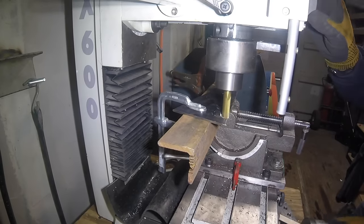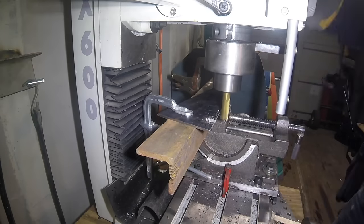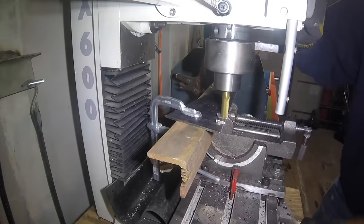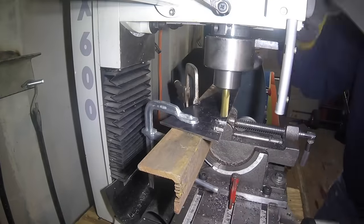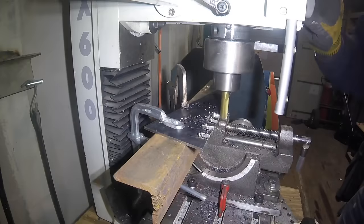What I do here is just touch the cutter to the edge to get it lined up. This is a half-inch end mill I'm using, and then I went in three-quarters of an inch on each one of these cuts. For that depth I did indeed use the dial so that they're all at the exact same depth.